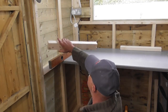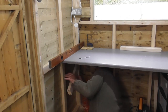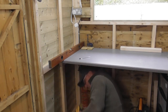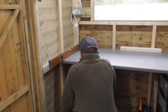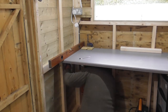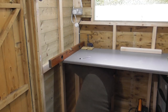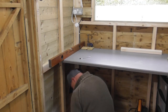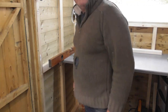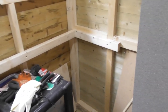So I've got my piece of timber — I've decided on 500mm, three screws pre-drilled, ready to roll. I'm going to get myself underneath the worktop, hold that up firm, put the front screw in, double check my level — yeah it's good — then put the other two in. I've done the left and right hand sides, and we've got basically a flat level U-shape frame now that the worktop can sit on. I'm going to screw a piece of timber across the full length into the end of these, right across from one side to the other, keeping it level.